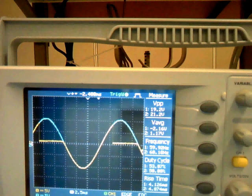This lab is to use a SCR to control a small DC motor. The circuit for this lab is quite simple, but here, to make the waveform more clear, I used a 10K pot and a 0.47 microfarad capacitor, and I used a 100 ohm 25 watt resistor.